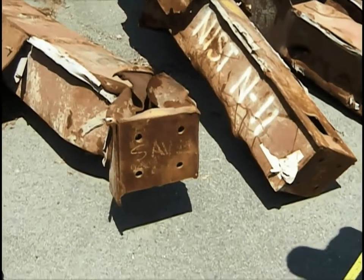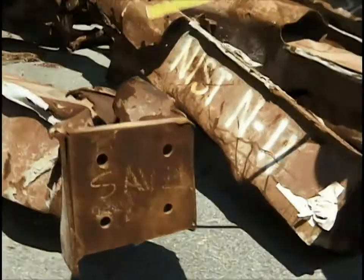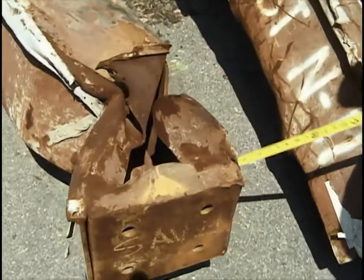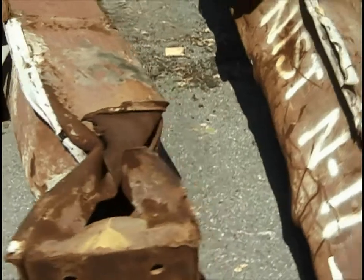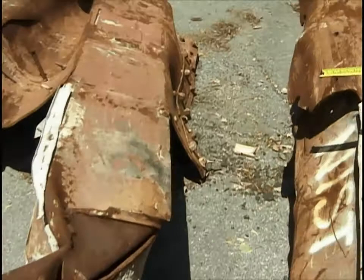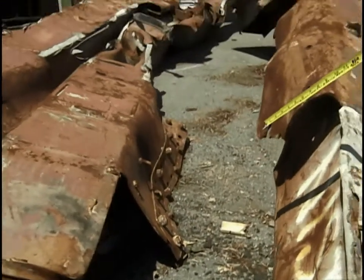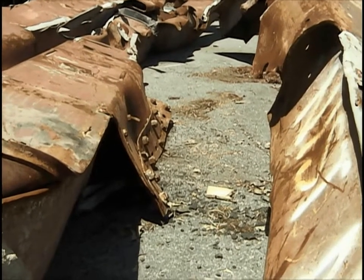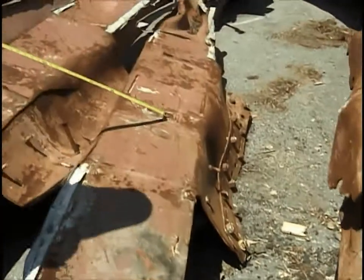Tree M2, top of column three. Welds are broken loose from the end plate. We have box collapse — looks like it's from an impact on one side, perhaps two sides. We have the spandrel connecting to the adjacent tree where the backing plates are intact and the bolts are intact, so it looks like it pulled through the spandrel on the next tree. The floor mounting hardware here is all gone. This is the level of where the concrete floor would be.